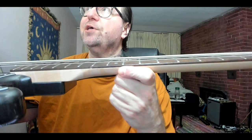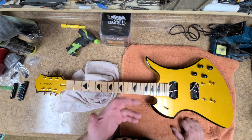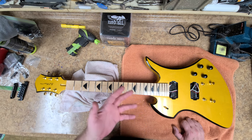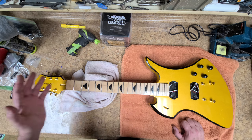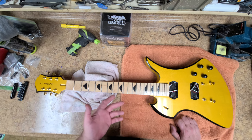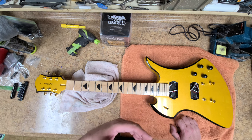Look at the action height on this guitar. I figured I'd work on this while the clear on the headstock is drying. I went through and cleared a little bit on the edge of the headstock, and I have to fix that — it's going to get fixed the right way. So I sanded the whole top face of the headstock, masked off the whole body of the guitar because from here down the guitar is done. It's just the headstock I've got to buff out. I reshot it with clear — that's hanging up in the other room curing, and should be 100% cured either Friday or Saturday.